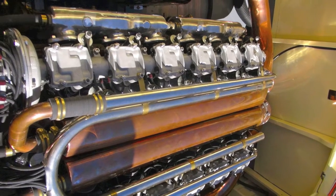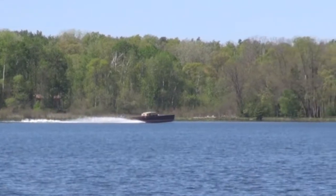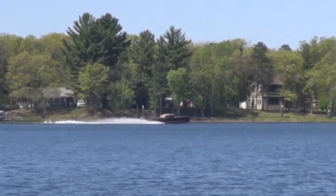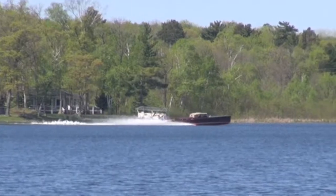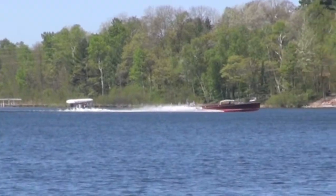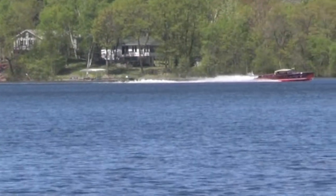We had it out yesterday and it's going around 55 miles an hour at about 1700 RPM. Like every Liberty engine, this engine has a sweet spot at 1400 RPM. I'd say you're going about 42 or 43 miles an hour and everything settles down — absolutely no vibration.